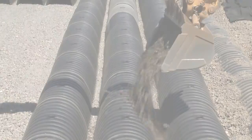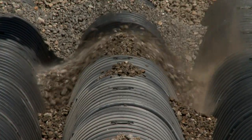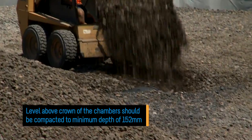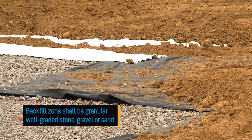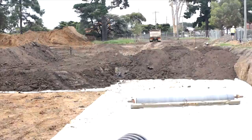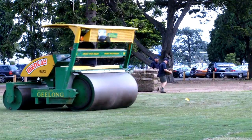Backfill: The material to be used for the embedment zone shall be free draining, clean, crushed angular stone 20 to 50 millimetres in size. Place the stones in even lifts between each row of chambers, then over the top. The level above the crown of the chambers should be compacted to a minimum depth of 152 millimetres. It is important to separate the embedment backfill zone from the initial backfill zone for retention applications, so a non-woven geotextile can be used. The initial backfill zone shall be granular well graded material consisting of stone, gravel or sand conforming to AASHTO soil classification A1, A2 or A3. A layer of general backfill material is then placed; any suitable native or general backfill can be used and should be placed in accordance with engineering plans.